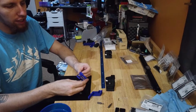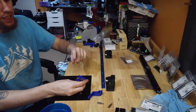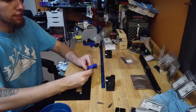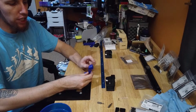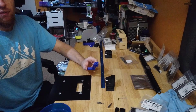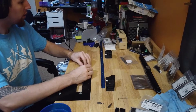Those button heads down, and then when we finally mount this cross rail to the main gantry, run a couple screws up, and it's good to go. The other thing is we need to have the tape chain mount, not the tape chain, the drag chain mount all set. Really all this needs right now is 3 heat set inserts on the top.